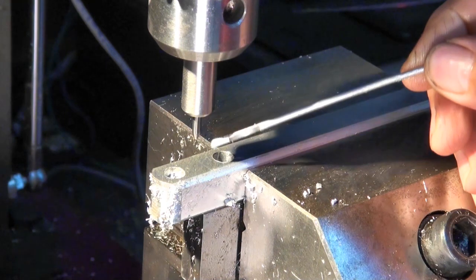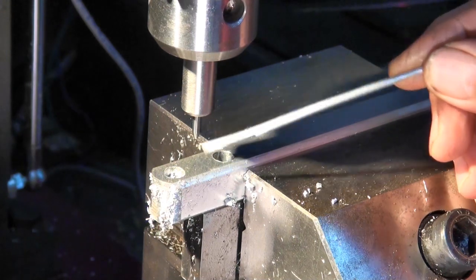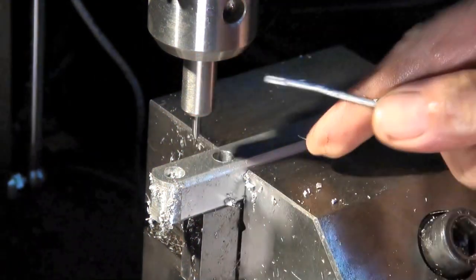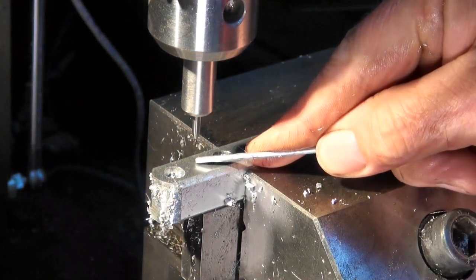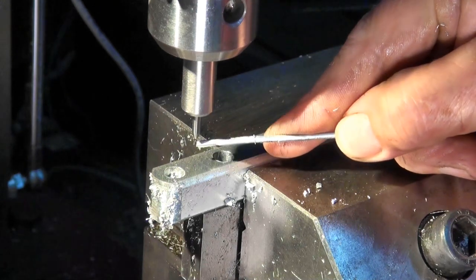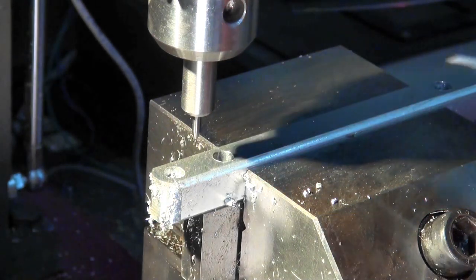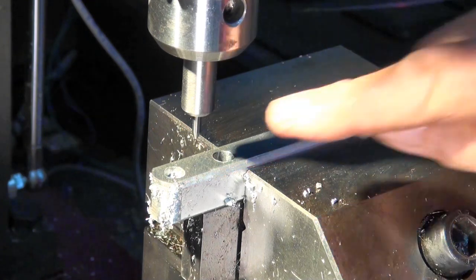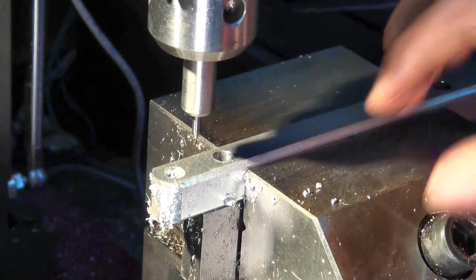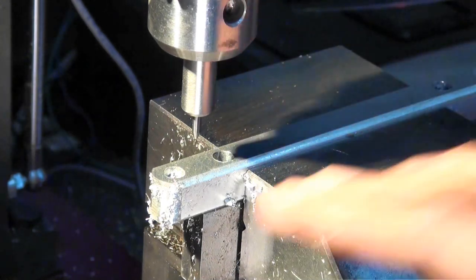Just for laughs, and perhaps to show that this is going to be a better outcome, I'm going to engrave my name into this one. I'm using a diamond drag engraving tool — these things are spring-loaded, and you set the diamond tip against the surface. The depth of cut determines how much pressure is put on that diamond stylus. I've worked this out to a 5mm depth of cut, so it's going to engrave quite deeply into this soft material. This works really well on hard material like 4140 steel — the diamond tip really does penetrate that surface, although it will raise quite a big burr which I can file off later.